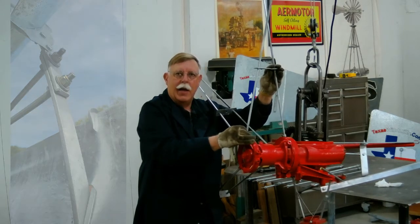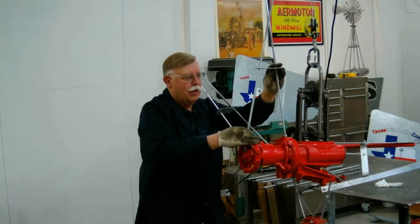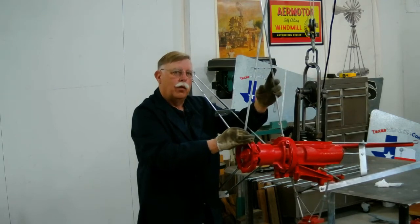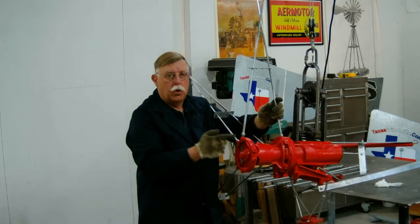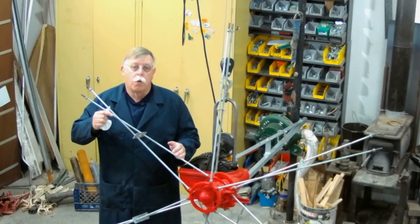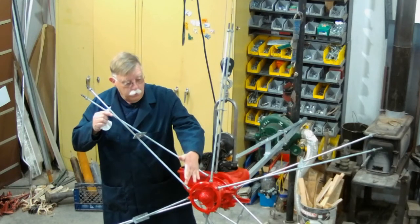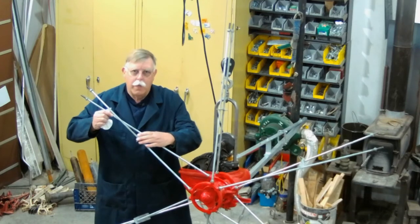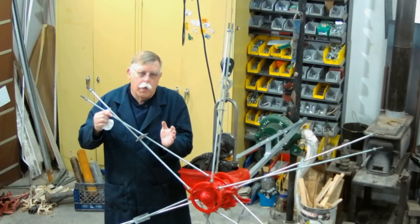And then just jiggle it a little bit — look at that, it goes in by hand. Also, lots of grease on there. So remember, don't fight gravity. Don't be afraid to wiggle a little bit, but just take your time and don't cross-thread these. While the wheel arms are on, remember that we have one in the front and one in the back for each pair. Slide it up and down, but get it about midway and you'll be okay.